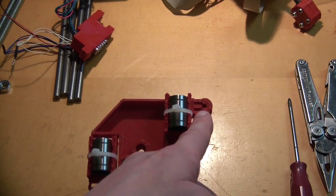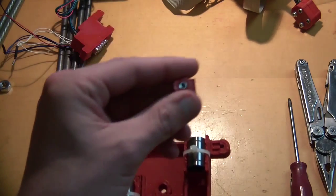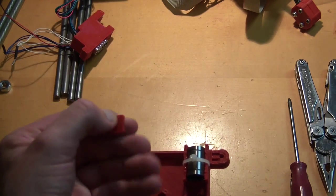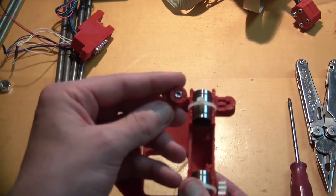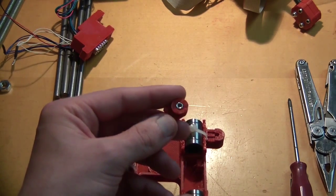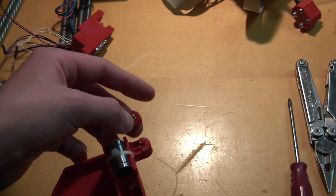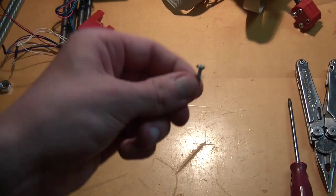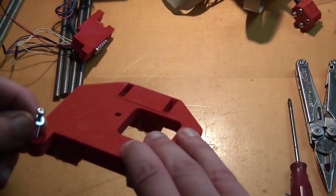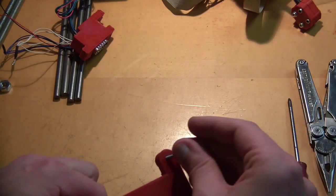As you can see right here, there are a couple of teeth. That's where the other side of the belt goes. You have this part — there's also a nut trap, so you just put a nylock nut in here. That's where you need a nylock nut. And that comes on there like this, so I'm just going to screw a screw in there. But don't really fasten the screw, just rotate it a couple of times.